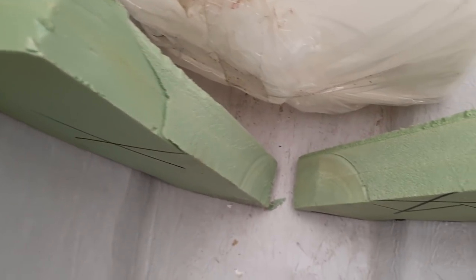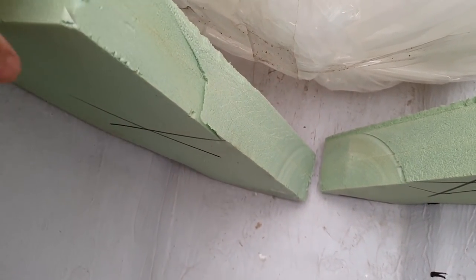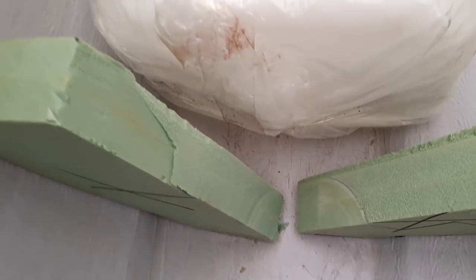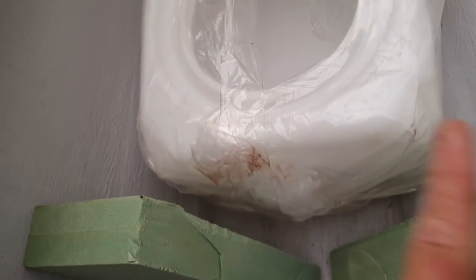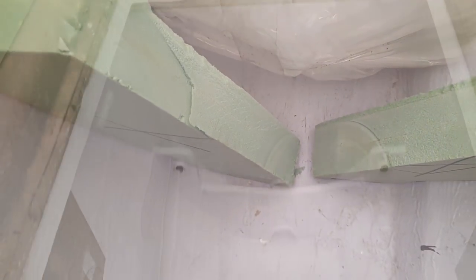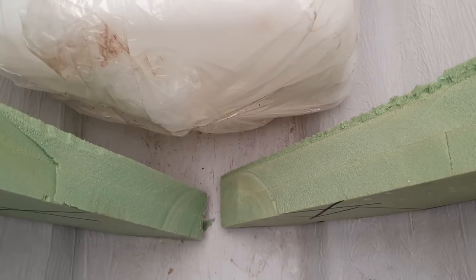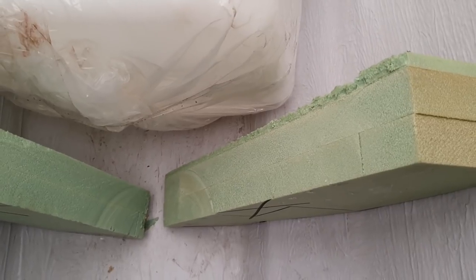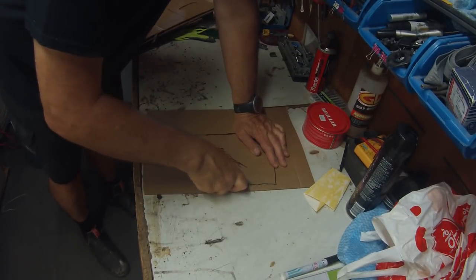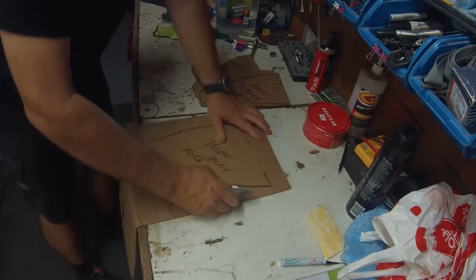I'm going to put these foam blocks in here, make them smaller than these, and have the tank physically sit on them. Then I'll put some carbon paddle shafts through there with straps that tie over the top. These are going to be a lot smaller than the ones I did with my fuel tank. I don't think these 78-litre tanks really warrant a ton of strapping, but I'll make sure they never move. I don't want any wood down here in the bilge, so this foam will certainly do the job. I may even use the thinner 30mm foam rather than 60mm.